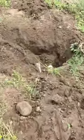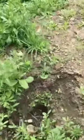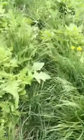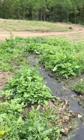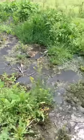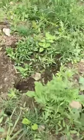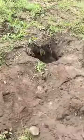Traveling downward during excavation, we made some incremental holes until we located the piping network and followed the channels. Here you can see the infiltrator with water backing right up and creating a path down the roadway, causing a lot of environmental concern. What we had to do was work backwards, locate that one trench, keep digging until we located the distal end, then make marker holes to locate our distance back to the distribution box.